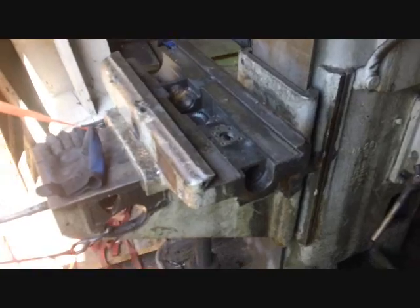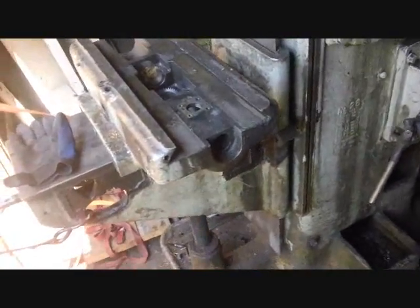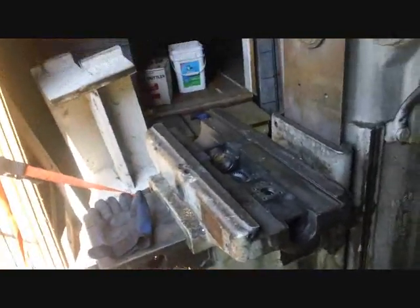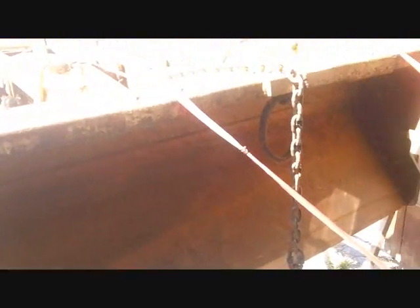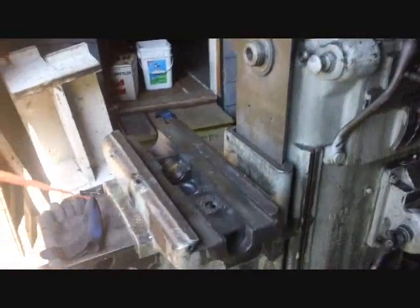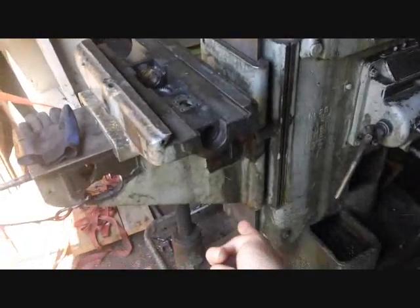I'm not trying to salvage the saddle or the knee itself, but I am trying to get some gears out of the inside of there. Also, in case somebody needs one, I'd hate to bend this shaft or that shaft. So I'm going to try and avoid dropping it, because it's going to want to fall forward on one or both of those shafts and bend them. I'll get the loader up close to the door, hook a strap to the rear around that post, and hopefully pull straight up on the knee to see if it'll come off the pin.